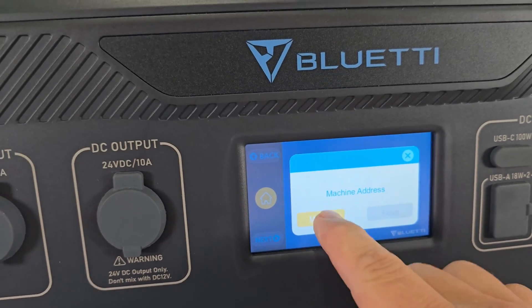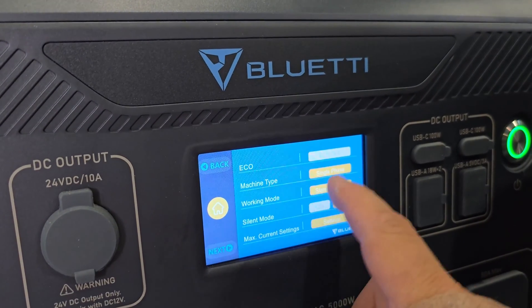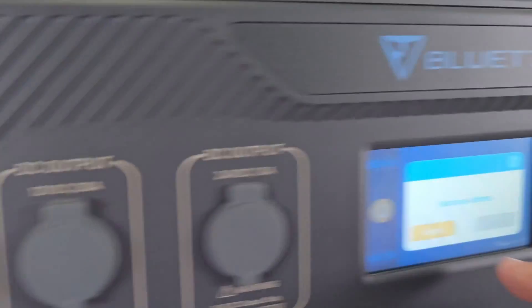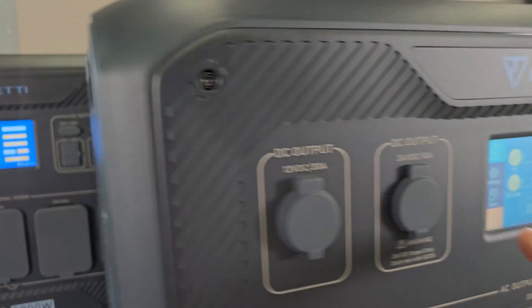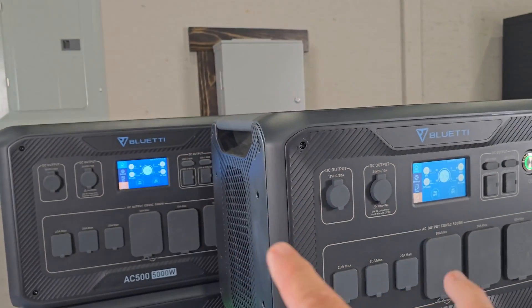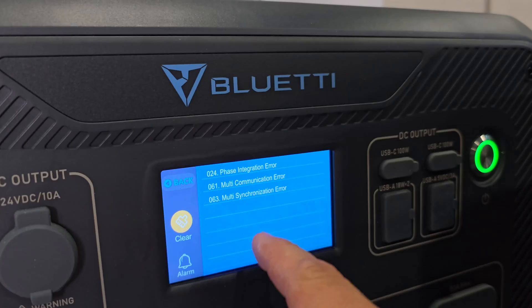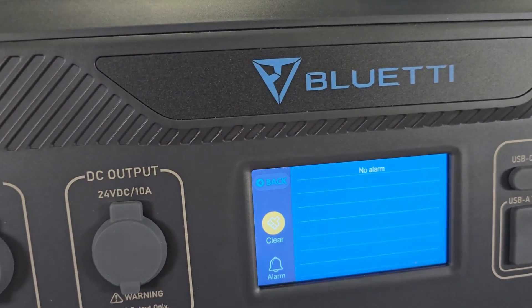You're going to get some alarms that go off. The communication port is hooked up and we're getting an alarm on the other one as well, but that's what's supposed to happen. We're going to change that one from single phase to split phase as well and make sure that's set to slave. Hit X on that one — now we have split phase there. Hit X on this one — we have split phase here. The alarms will go away when the communication between the two units pairs up. Once they pair, clear those codes so you don't have to keep seeing them.